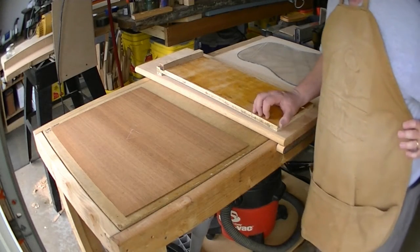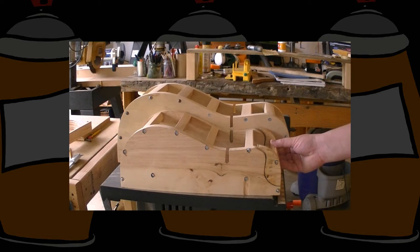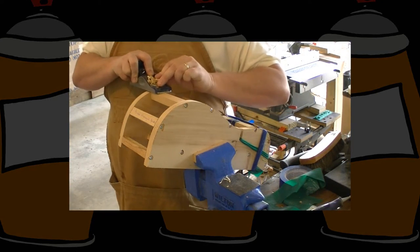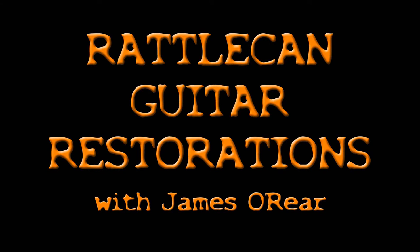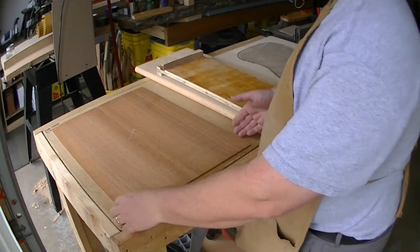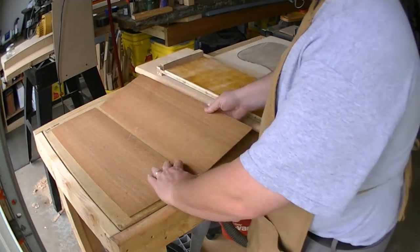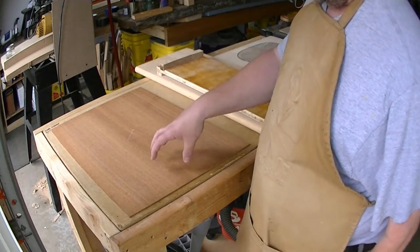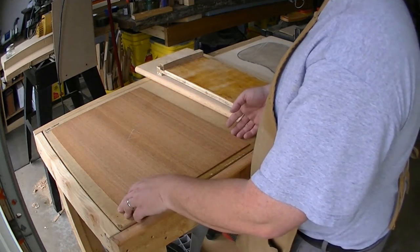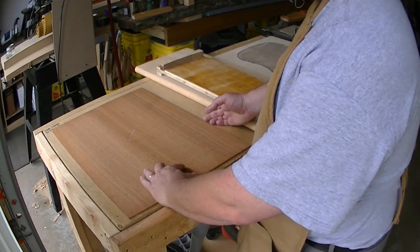Hey, welcome back. We're going to do some prep work for plate joining. I've got two different things to join here. This is an African Mahogany back, also known as Kaya. This is the same sides that you've seen us work with for the dreadnought. This is the back — I actually bought this as a back and side set from LMI. So I have to make this edge true so that we can glue it up in our plate joiner.